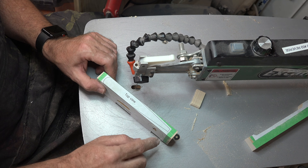Once you peel off the tape and patterns, the body of your plane will have the cutouts and some shape top and bottom. At this point I want to sand it to level out where the scroll saw stopped the cut, then give the whole body a nice sanding all over before we carry on with the next step.